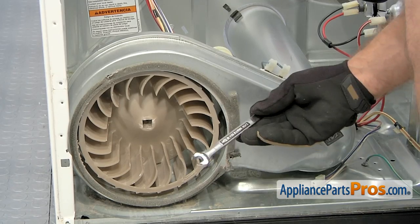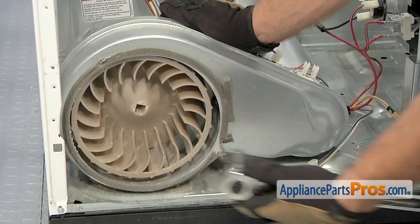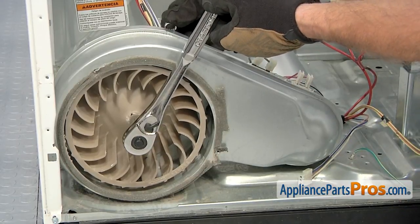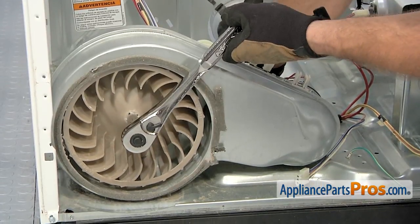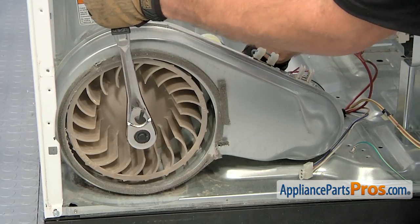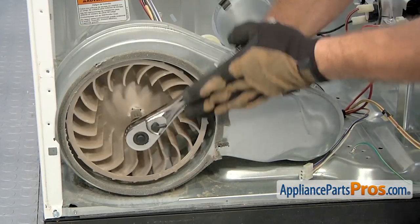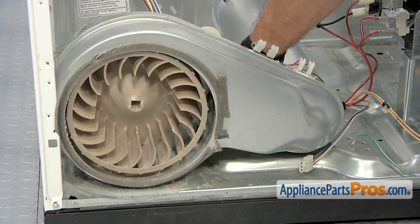In order to get the blower wheel out, we're going to take a 7/16 inch wrench and put it onto the motor shaft behind the blower housing — there's a flap back there. Then take a half inch ratchet with an extension and put it into the blower wheel. There are arrows that tell you which way to turn it. Hold the wrench until it bottoms out, then turn the blower wheel. Sometimes it comes right off, sometimes they're really tight. If it won't budge, give it a snap movement to break it free. Sometimes you have to chisel them off, but once it's broke free, you can pull the extension out and turn it by hand to get it out.